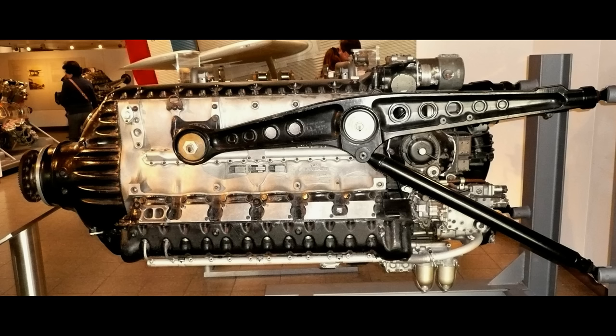However, it appears that it was tough. Furthermore, as I said, it could run higher RPM than many other engines in its class, and that helped it make power a bit. So it certainly wasn't bad, but I do think that the DB603, if prepared with the same features, would have been better, especially since it has a variable speed supercharger drive.